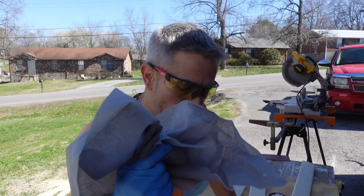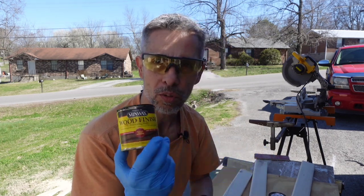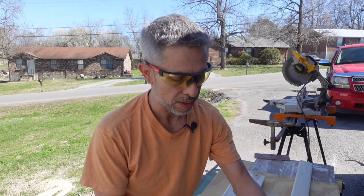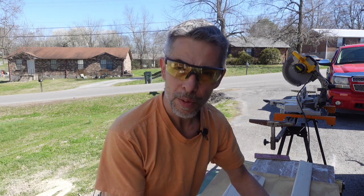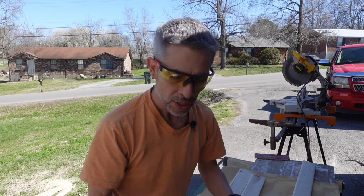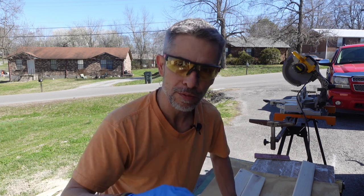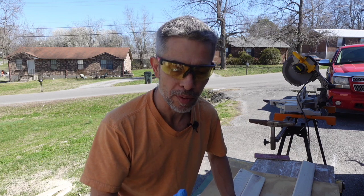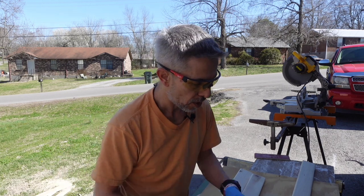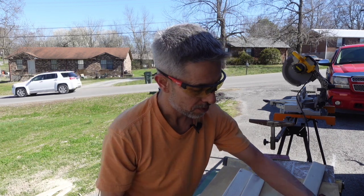I've got the rag here and I'm fixing to start staining. The ones I've grabbed are golden oak, walnut, dark walnut, and honey. I'm not sure what they're going to look like because they look different on oak versus pine - we're doing it on pine. It was a little dark when I did it on oak, so I'm hoping I get a light brown. One trick I'm doing is putting it on in layers, coming back with a sander and sanding it off, then putting a clear coat on - because the wood fades rather than chopping off from light to dark, making it splotchy. I'll start with golden oak since it's the lightest. It's not as dark as I thought it was going to be. That's awesome.